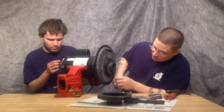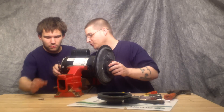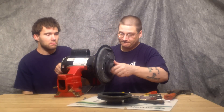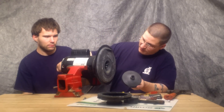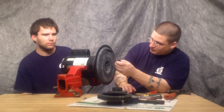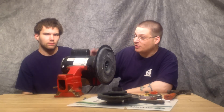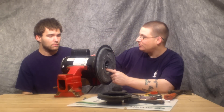So once you do that, Robert will put that into the parts pile. You'll want to grab the shaft and then you can spin your impeller right off like that. There is your impeller. Here's one part of your seal right here, and your second part of your seal is inside there. Watch the next video — I'm going to show you how to remove the seal plate housing and how to pop out the seal.